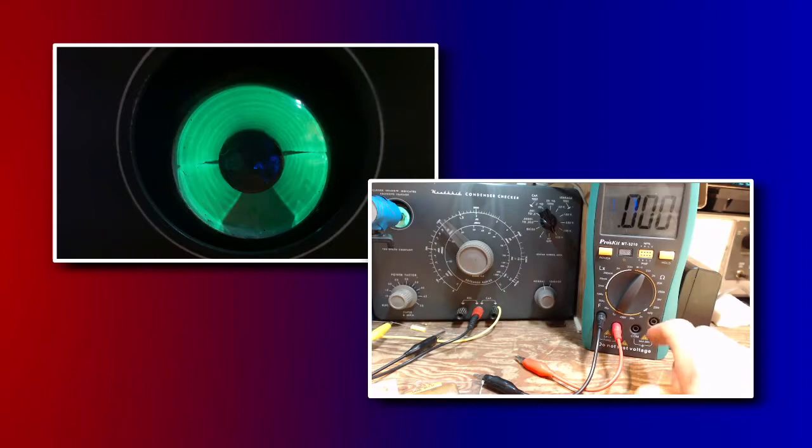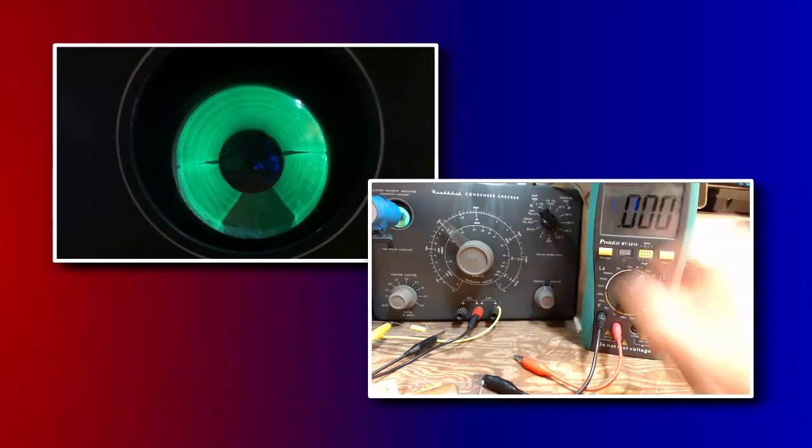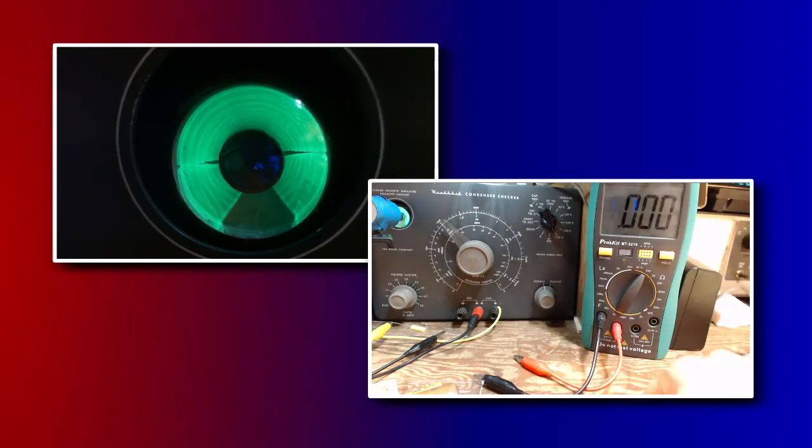What is its actual capacitance? Wow, that's an interesting question. Interesting question, because perhaps the condition of the capacitor is fooling these instruments entirely, and maybe the capacitance is actually very, very low, but because of the way they operate, a leaky capacitor looks like one with a lot of capacity, and these instruments are fooled by that. So in a sense, the only valid test is this leakage test. It's the only one that's going to separate the men from the boys, so to speak.